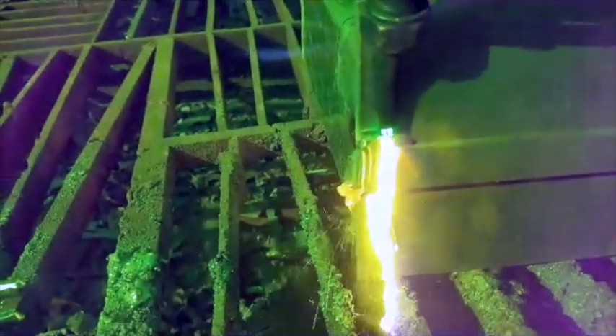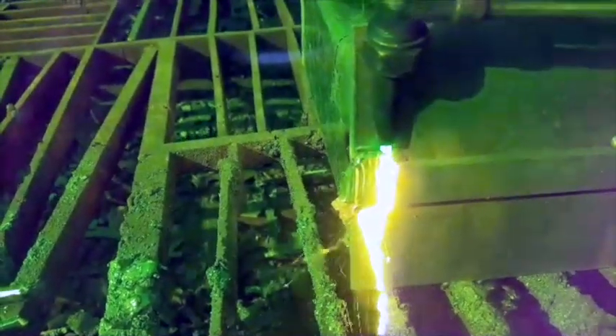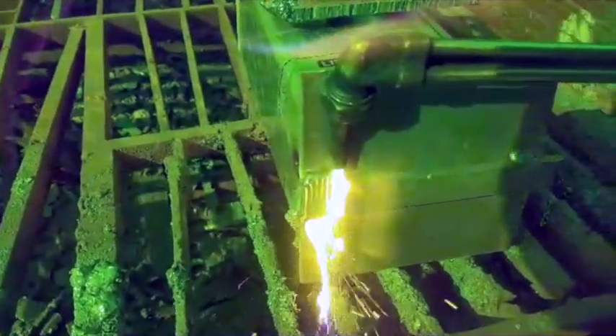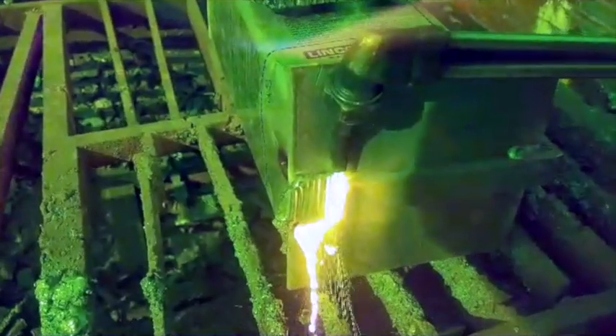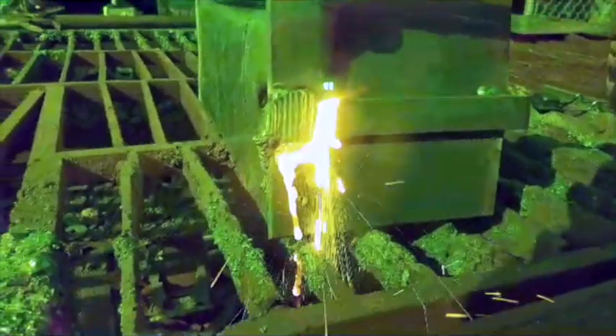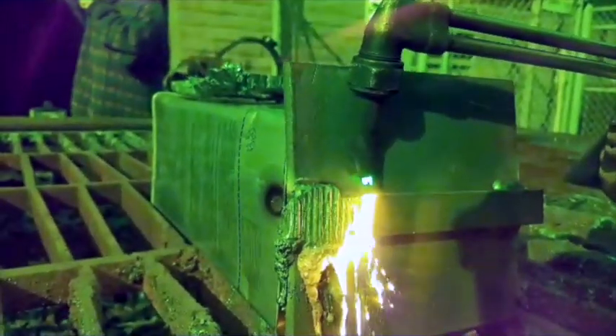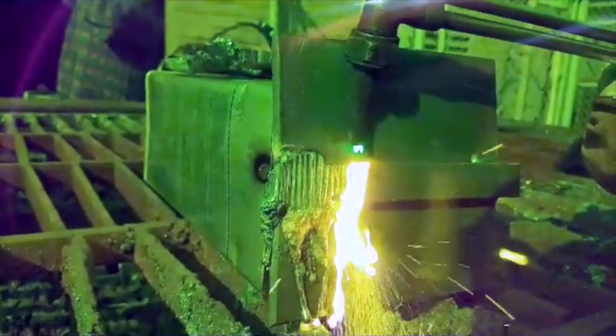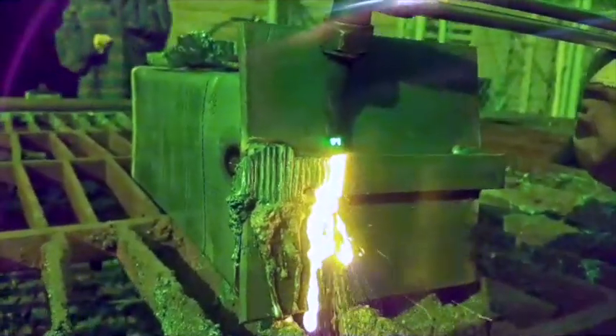I like rolling this in and out because I can see how deep I'm cutting. I'm going to get rid of these welds. Now I'm down to the nitty gritty here. I'm watching the top edge of that backing bar where it meets the parent metal, and as soon as I see it start breaking down, I know it's coming in — and then it's in and out.